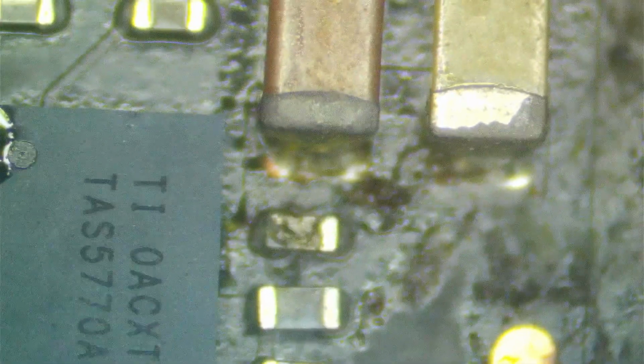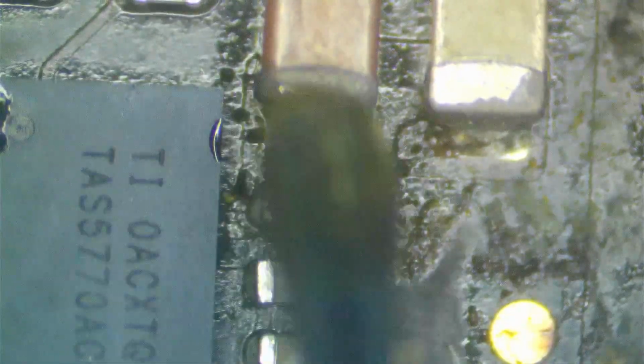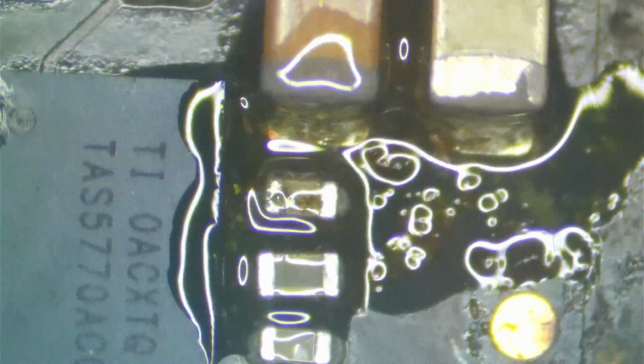So, speaker amp, that capacitor is also, again, what I'm looking for, I'm looking at the inside of here. I'm looking to see if this cap is all ruined at the end and falling apart, because that means liquid could have got into the capacitor itself. But if the cap is actually intact, the chances of liquid getting in there are pretty low. So that's what I'm looking for. And the caps are fine on these. The actual end cap of the capacitor itself is fine.